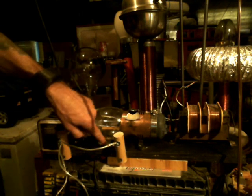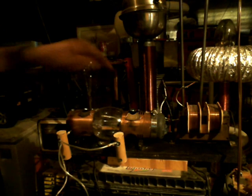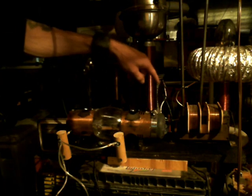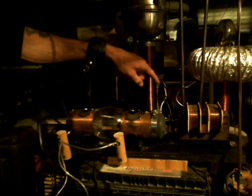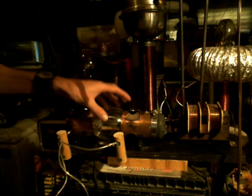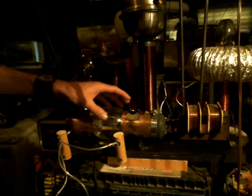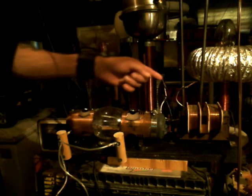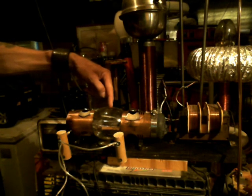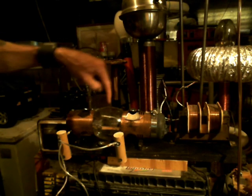At the very bottom down here there's another set of magnets which are south on this side and north on that side. I'm firing a 20,000-volt oil burner igniter into what I'm calling my plasma chamber, which is essentially an old burned-out bulb with some argon gas in there. The energy comes in, energizes the argon gas, and the magnets begin to swirl it around inside there.